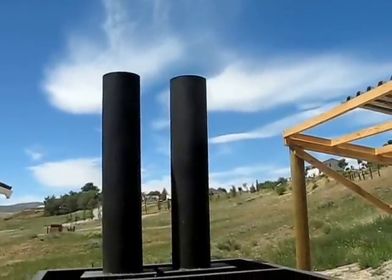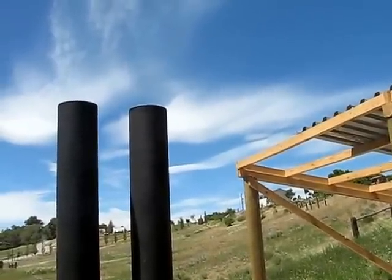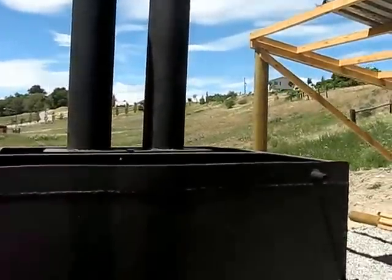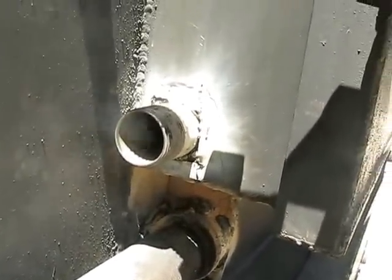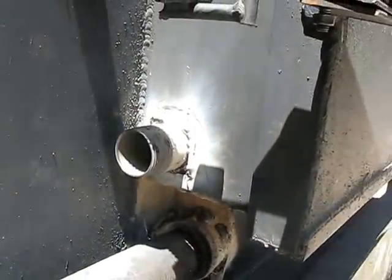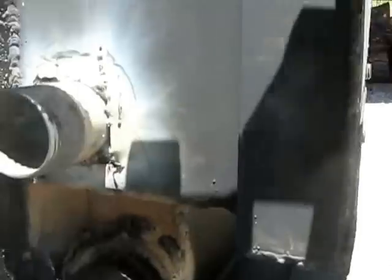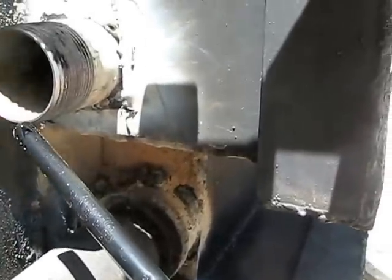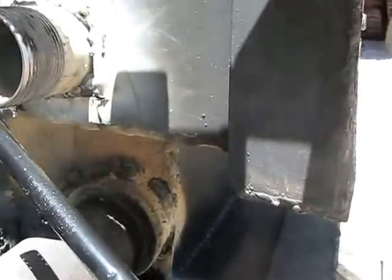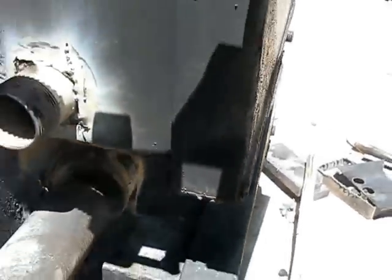It's pretty clean but it could be a little better. Could be that I have some leaks from the primary to the secondary that aren't forcing all the smoke to go down through that injection nozzle — I need to weld up some of those leaks. There's an example of a leak here: smoke coming out not out of the pipe but out of where it's welded through the metal. I got my lighter here and you can see the smoke come out and get sucked back in — I'll light it and you can see it pulls that flame in.